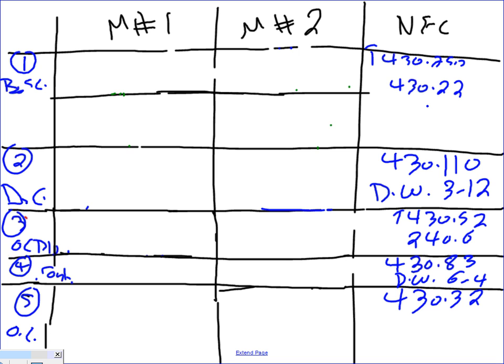Okay, any question, guys, about this? Before we go ahead and start doing the calculation, a few things I want to remind you. I kept these for you, so I'm just going to read them. We need to go to table 430.250 to get the full load current. And if you go to article 430.22, Chris, it will tell you to size the branch circuit for the motor. The branch circuit for the motor, you need to multiply it by 125. Okay? So let's go ahead, right in here.